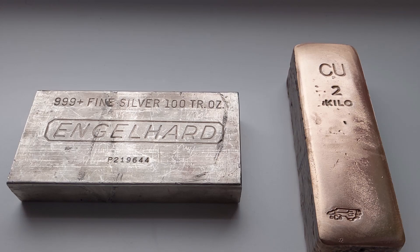An important word of caution is that this test may not be very useful in identifying large silver bars that have been partially hollowed out and filled with a base metal. The outer shell of silver may be enough to create the diamagnetic effect, rendering this test ineffective for spotting fake silver bars of that nature.